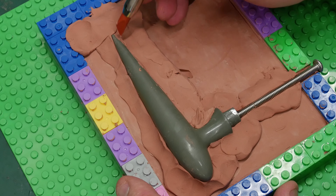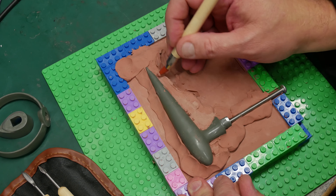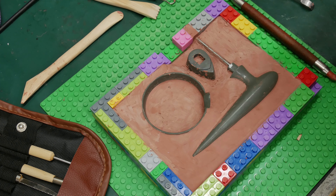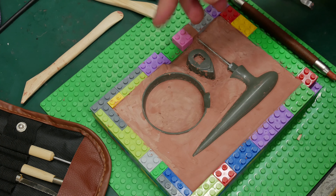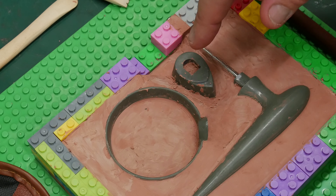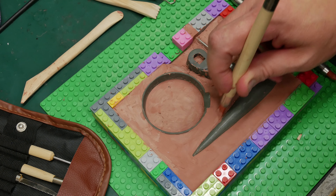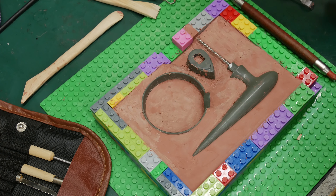This is my favorite tool for refining that edge — it's just a silicone nib. I'm trying to build the clay up to the halfway point. I'm going to keep working on this, get this edge refined and get it to where I'm happy with it. I'll leave links down below to this tool as well as some of the other tools I've used in this project. My first concern is I like to have a little bit of silicone around the parts so that when I pour my metal it's not too close to the edge. I'm thinking of maybe jutting this out a little bit. You can slap this together really fast or you can take your time — it all depends on what kind of job you want. I'd kind of like it to be nice, so I am taking my time.